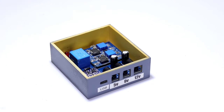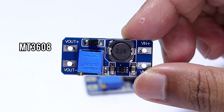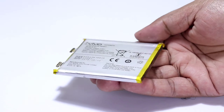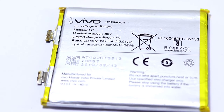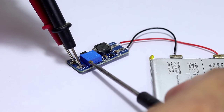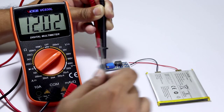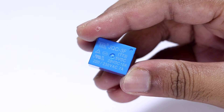The basic idea is to use a boost converter like the MT3608, and an old LiPo battery from a mobile phone which is 3700 milliampere-hour in capacity. I have connected the boost converter with the battery and will adjust the potentiometer so that the output is 9 volts, and further up to 12 volts. I will utilize a 5-volt relay as a switching device.